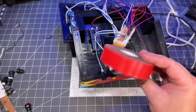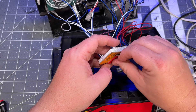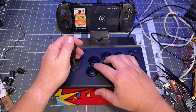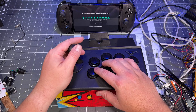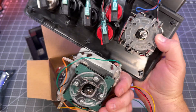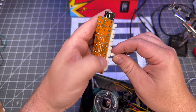I'll use 3M tape to attach the encoder board and press it down into the bottom of the controller unit. Before putting everything back, make sure you've hooked up all the switches and wired them to the encoder board. Check the joystick first to make sure up is up and down is down. With joystick switches, it's the opposite side switch because as you push the joystick to the right the inside moves to the left — keep that in mind when wiring to the encoder board.